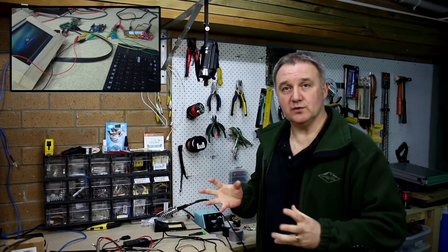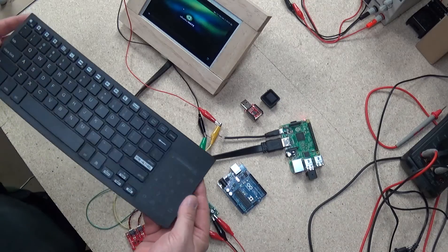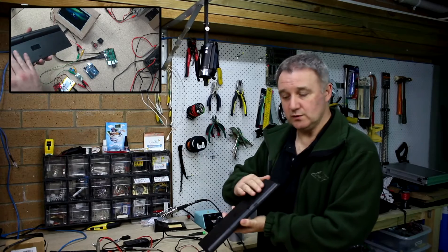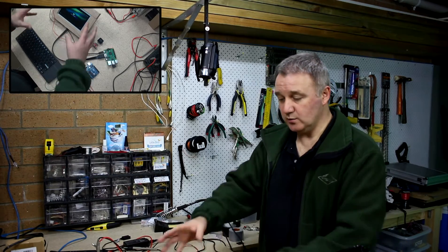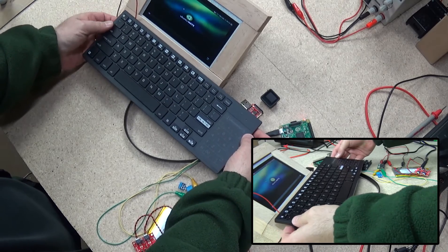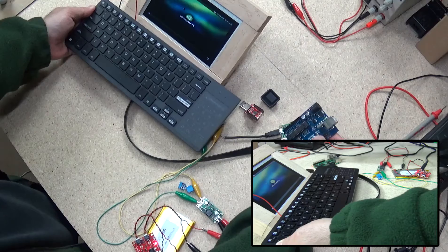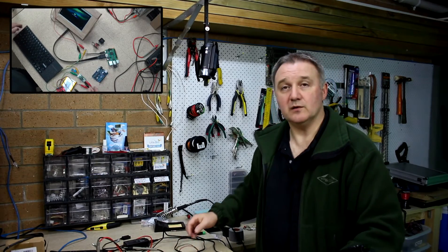I'll be trying to put all of this into a clamshell styled design. The keyboard is the largest single piece - the bottom half would normally be the keyboard, and it has that sculpted-out cavity section. I'm anticipating I can lay a few of the thinner components inside that cavity, forming the bottom half, with the top half being the LCD and driver board. Depending on orientation, I may have enough space for an Arduino either centrally or off to one side rather than wasting space.